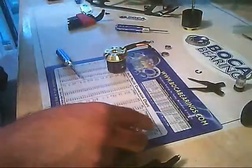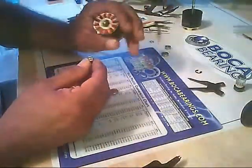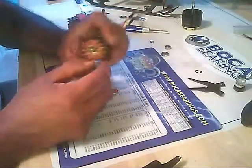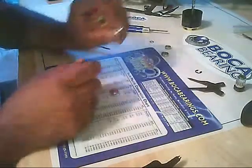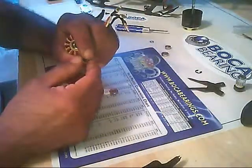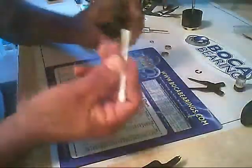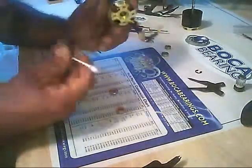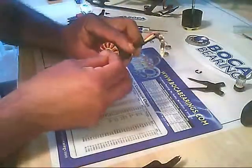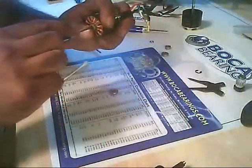To replace the bearings it is just the opposite. One important note for anyone upgrading from the 3026 880KV to the 3226 900KV: the lower bearing on the 880KV is 4 millimeters in depth, whereas the new one is 5 millimeters in depth — a major difference. You cannot use the 880 motor bearing. First, take a clean Q-tip and clean around the inner casing, then install the bearing making sure it is flush and not sitting at an angle.